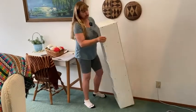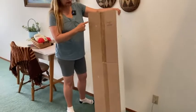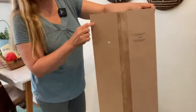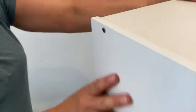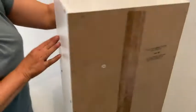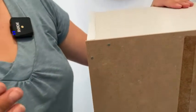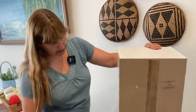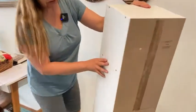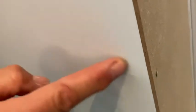One other tip: when you're attaching the back piece, watch where you're putting your nails. Make sure you're aware that you've only got this much distance on the edge. When you go to hammer them in, if you get one too far to one side or another, you can make a bubble in your wood. I got really close right here — not really noticeable if you don't know about it, but I can see it, and that's from this nail going in at a slight angle.